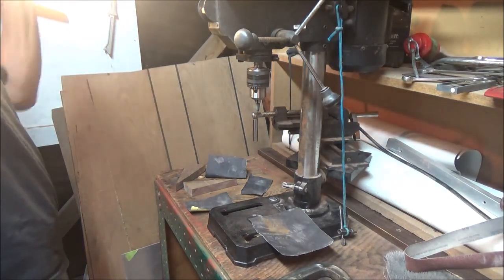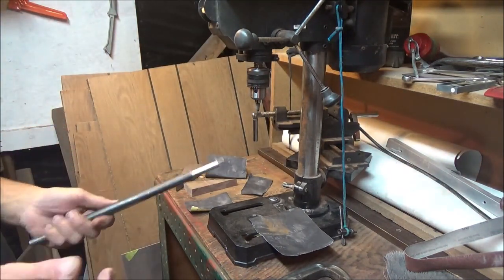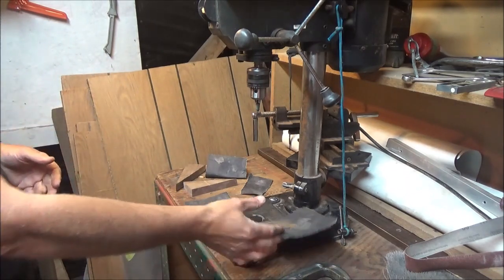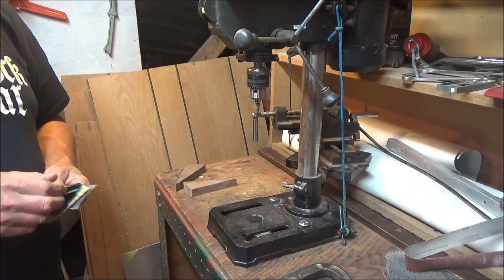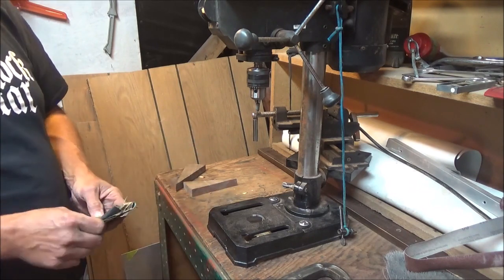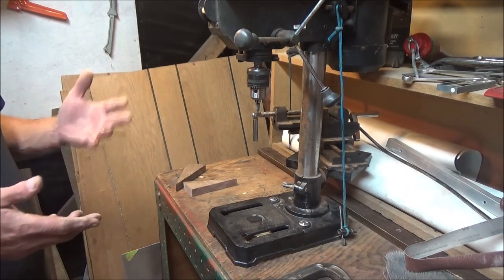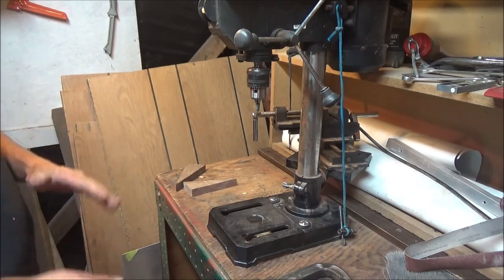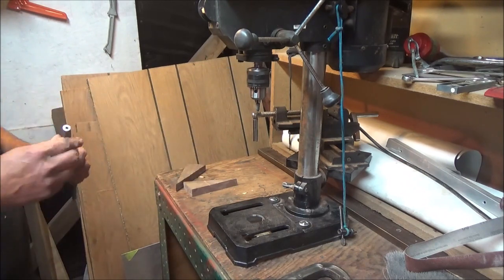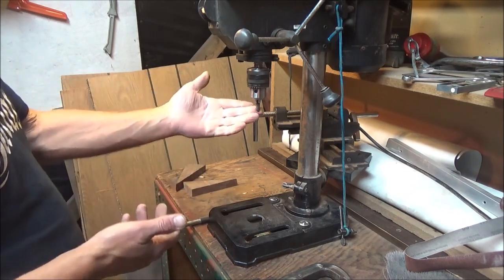You don't have to mess with crowns too often. Every time you do a barrel chop you have to — it's not optional. If you're not chopping, you can just do a polish cleanup on a muzzle. Some guns have a very poor crown job — Crosman is notorious for pretty bad crowning. I'd take any Crosman that's acting up, clean up the edge, reface it like we did here, and recrown it — all with just a couple of Dremel pieces.